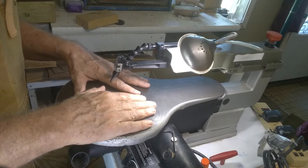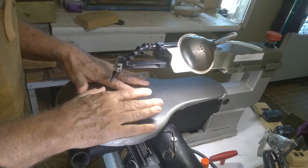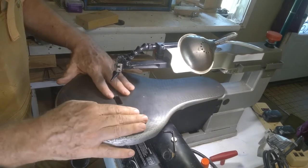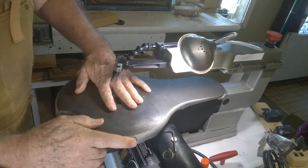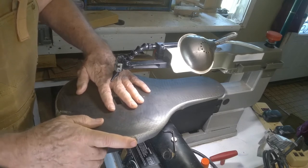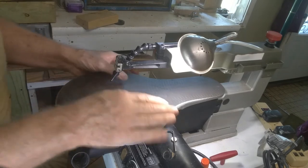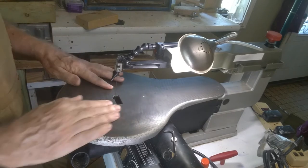You can control your on and off — as you're making cuts sometimes you might want to stop for a second and take a look, or it will hang on a piece of wood. If it's a tough wood with a reverse tooth blade, it can hang and you need to stop and get better control. Most saws come with a foot that sits down to hold your work down, but after 15 minutes I took it off — I couldn't see my pattern and it made it difficult to slide the work as needed. I'm not telling you to do that, but you're going to need your hands on the work regardless.